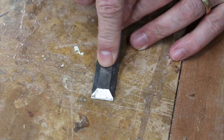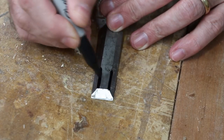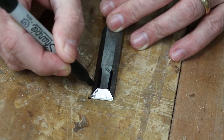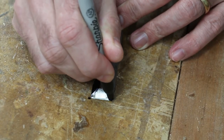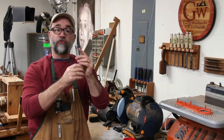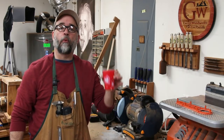In order to create the fishtail on this chisel, I want to keep the flat top portion of the chisel and I want to remove or grind away the two sides that are beveled on this chisel. I want to remove all of this metal over here and over here. While I'm grinding off all this metal, I'm going to be sure to keep the chisel as cool as possible by occasionally dipping it into a cup of water.